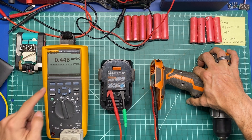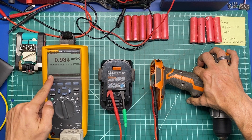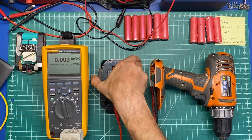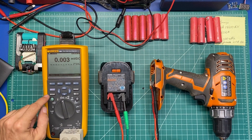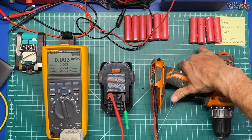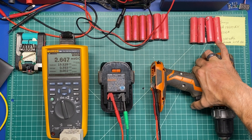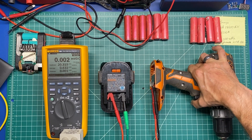So let's just do some basic on and off first. Going slow — that's about half an amp. And that's about one amp. Battery level fully charged — that little bit's not going to matter. I'm just going to try to get a general idea. Let's turn on mid-max. 19.5 amps right there. Drop it in forward — 20.8. Almost 21 amps.